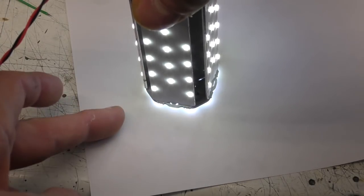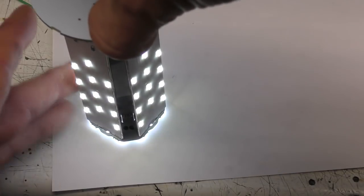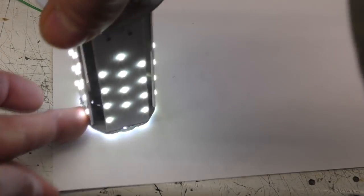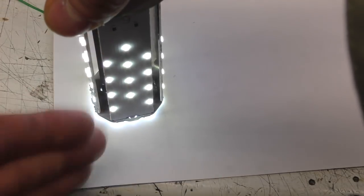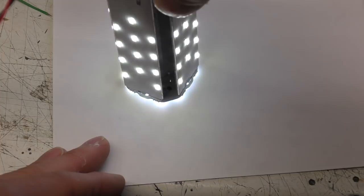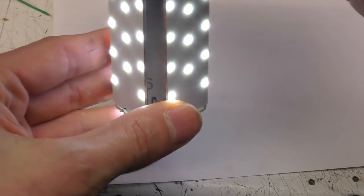I can't actually remember whether we ended up having it square in the cube or at 45 degrees, because there was a bit of a trade-off. One gave more even illumination, but at the expense of a slight discontinuity on the face, and with the other, the discontinuity was towards the corner, which is obviously a bit of a visual discontinuity anyway. So there were pros and cons of the two solutions. And the first non-intuitive thing is that having the corners going to the face actually gave probably the most uniform illumination.